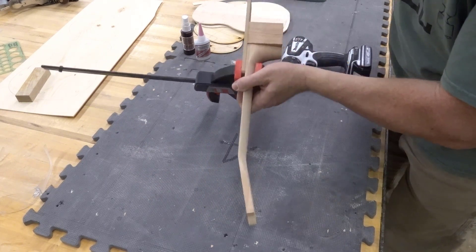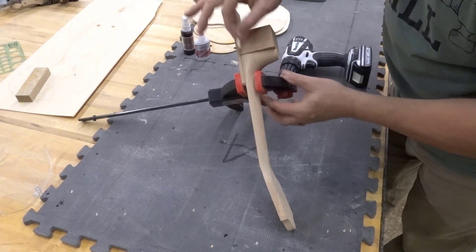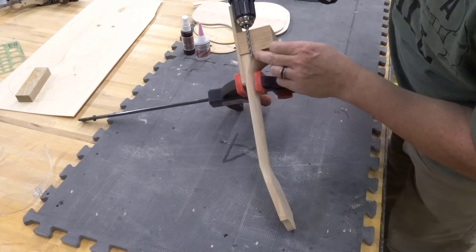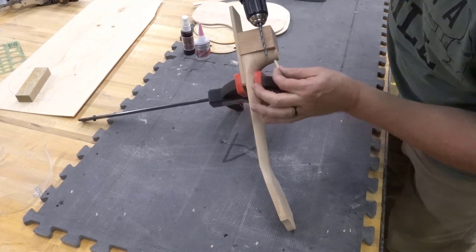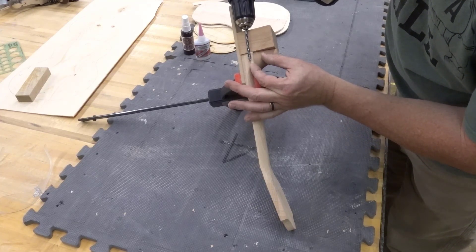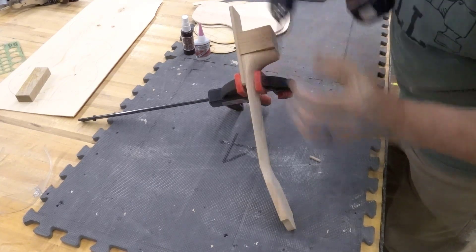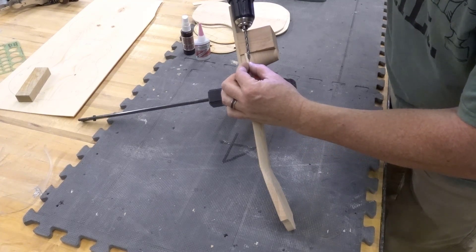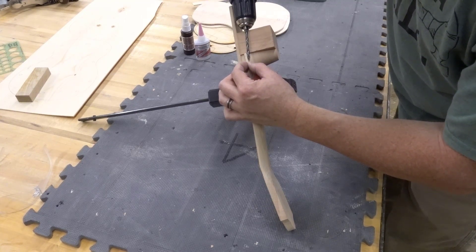Now this is on nice and tight. We're going to put these little dowels in between. We need to drill deep enough so we're drilling about halfway the length of the dowel — obviously I don't want to drill all the way through. I'd rather it be less than more. Right now I'm a little bit too much — a little over halfway — so I'm going to move the bit into the drill just a little bit, tighten it down again. That's about right, it's about halfway. If it's a hair off, that's okay, because the other side we drill all the way through, so there's plenty of room for it to extend. That's how far I'm going to drill.